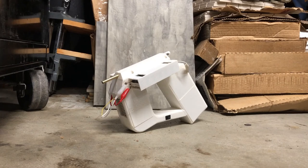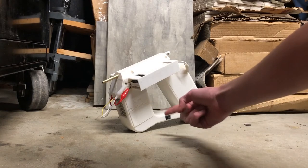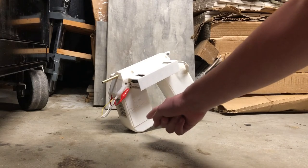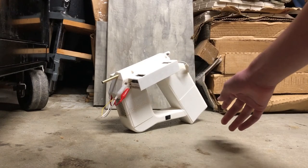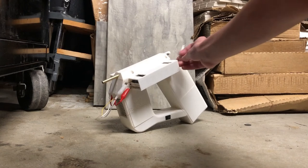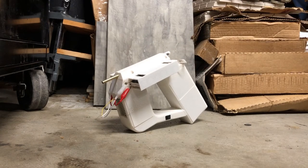This gun specifically works by taking 12 volts in this portion, sending it through here — that's the switch — to charge into here, where it's bumped up to 400 volts into these capacitor banks held onto the sides. When it's ready, the trigger is pulled. The trigger is a light switch because it's the only thing I have that can handle the 400 volts, and that is discharged with the alligator clips clipped onto those into the foil.